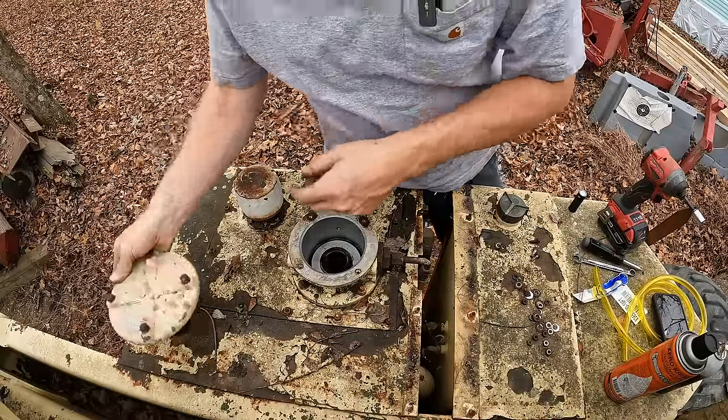I think the way this is designed, though, I can just cut out the bad spot and reattach it. There we go. I'll just take that ferrule off the end there, slide the nut back past the bad spot. All right, we should be able to just reinstall this thing, tighten it down, and have an accurate oil pressure reading.